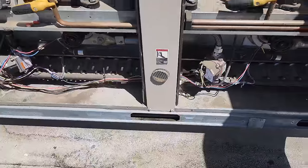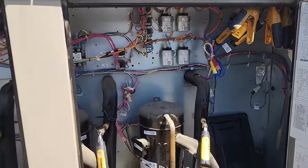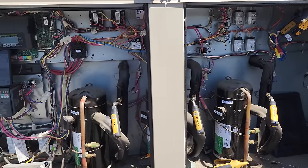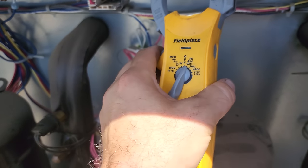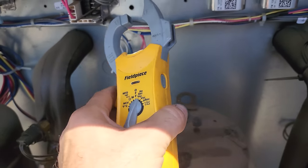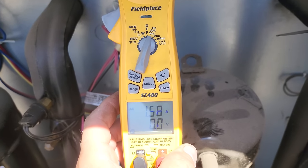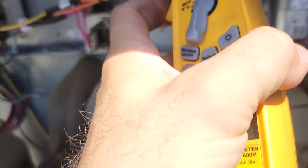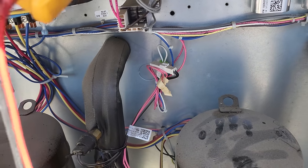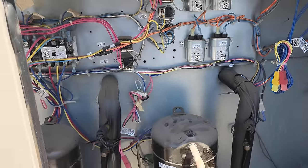It's saying 110 degrees because it's just radiating off that asphalt. I'm going to take all the probes off and then we're going to amp out all the condenser fan motors. Even though we know it was a dirty condenser causing high pressure, we still have to test the fan motors too. The outdoor fans are allowed to run 2.4 amps. Readings are 1.73, 1.6, 1.6, and 1.6 — so all the condenser fan motors are fine. No issues there.